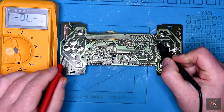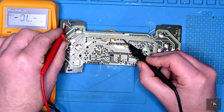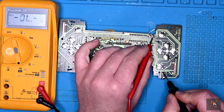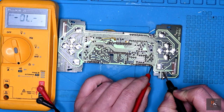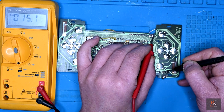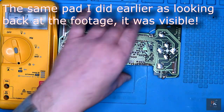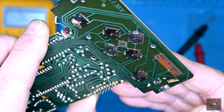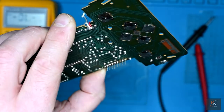when I trace the power here, I can trace the power no problem at all. It runs around the board, up to here. It then goes from here across and then jumps over and then into the chip, no problem. When I do this side, follow the trace round, it comes to here, where the power socket is, and there's nothing. Now this power socket continues on and then runs through here. So there's nothing here, but if I go back here, I get contact. Move a bit further, nothing here, contact. The track has been cut. It looks like somebody's resoldered this. And hopefully you can see down in here, the track's been cut. So the first thing I'm going to do is clean up some of the trace, run a wire, resolder, sort this wire, and then we'll take it from there. We'll see what happens.